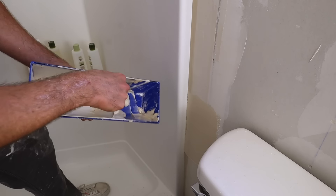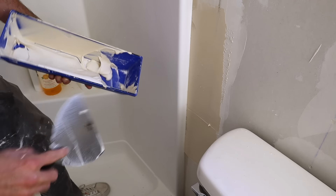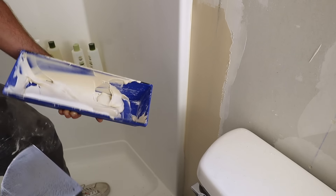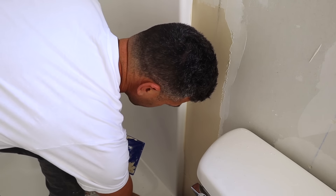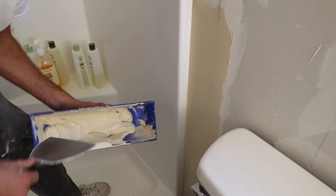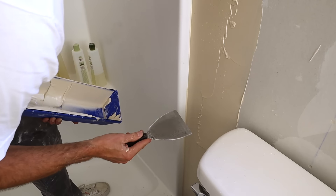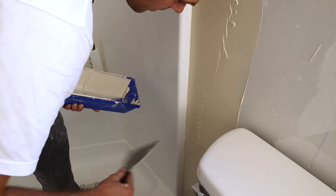Just fill — you can try and keep your knife or your mud blob a little bit closer into the blade so it doesn't spread out so much. When I scoop this, it starts right here, but I can give it a quick little shake and that helps stop you from getting so much spilling over the edge. It's still going to happen but it doesn't have to be so much. We'll go a little wider to bury that quick set edge. The flange isn't flat so it's tending to want to spill out the sides no matter what.